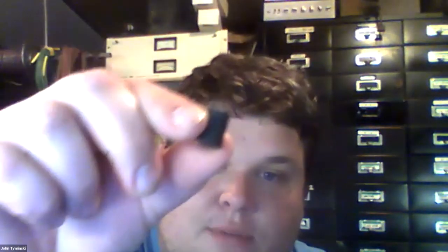The same with these guys. If you've never worked on one of those, it does not have springs underneath the changer board to dampen the vibration like a normal turntable. It's got these rubber cone bushings. And Renovated Radios has them, but I can get them cheaper from voiceofmusic.com, which I think buys them from Renovated Radios in the thousands. That's probably what it is. They buy such bulk that they pass on the savings to you. Yeah, but you would think that the place that was making the damn things could pass on the savings to you. It's funny how the opposite could be true in that case.